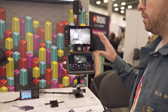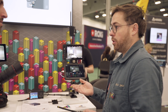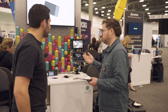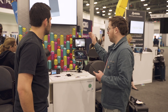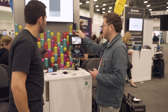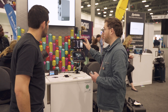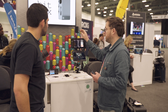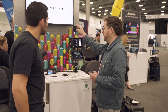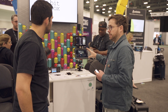You can do it on an iPad using the camera manufacturer's app. Each camera manufacturer has an app to control their camera, or a web-based GUI which you can access with Safari or whatever on your computer or iPad. We're also showing this with the new SmallHD Ultra 7 — it's connected over Ethernet, and you have full control and access to the menus with camera control in the monitor. The box has a switch in it, allowing multiple network connections at the same time, so one box is allowing camera control with the monitor and with the iPad simultaneously.